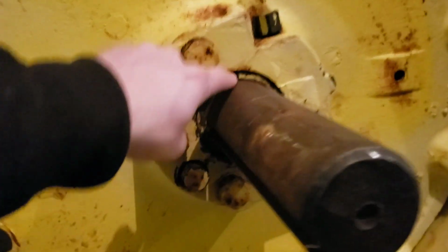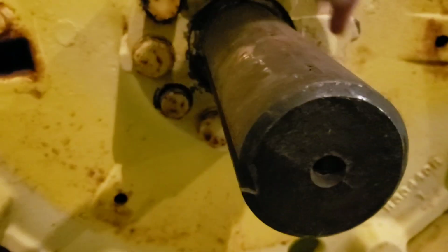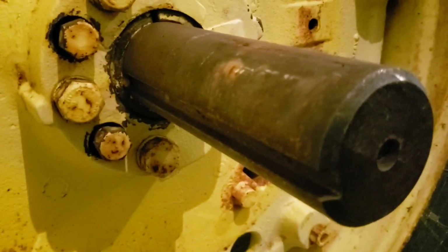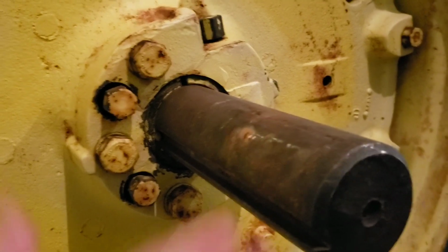So if you look at this, the wedges are, see, there's half. That gap right there is, so then there's the other half. And you got this rack and pinion deal here on the front of the axle, these little cogs. And this deal here is a pin that goes through, and it's got like a little gear, and it runs on these little chatter marks. And this wedge here has the keyway, which is what powers your wheel around. So if you can get this wedge broke loose, your wheel will pop loose, and it'll kind of tilt on you.